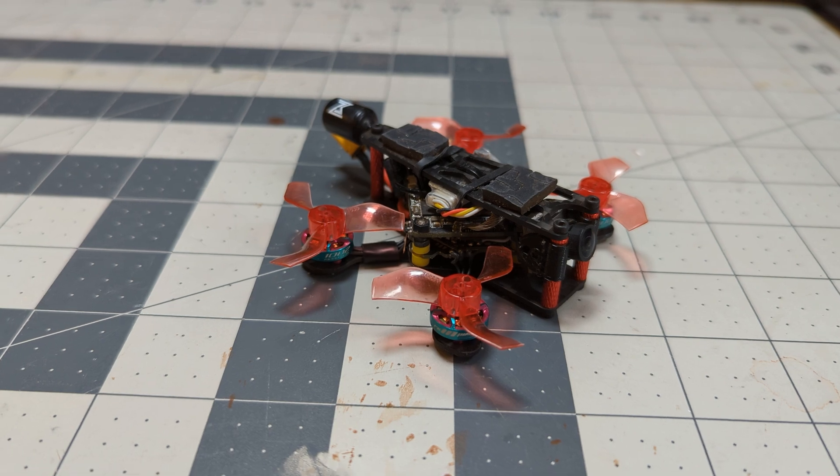That is not a whoop. It's a little bit special in that it is so compact, but it packs on board 1080p HD recording, 1080p video link back to the pilot, and as much range as you can get out of an ELRS ceramic antenna receiver on a 1S quad — flying these 550 milliamp hour XT30-ended 1S packs.